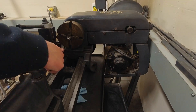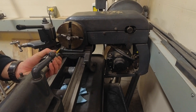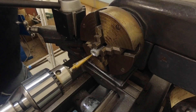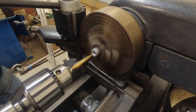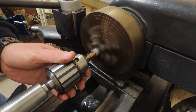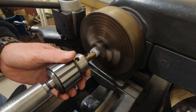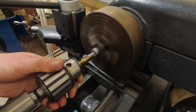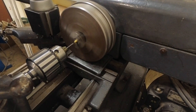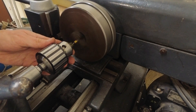The build notes say to use one of these cheap stepless drill bits as a tapered reamer to enlarge the bore of the hotend heatsink. These bits are intended for drilling holes in sheet metal, and I was skeptical of using one as a reamer, but it works pretty well. With a little cutting fluid, it had no problem reaming out the aluminum. I also used the lathe to drill out the brass nozzle from 0.4 millimeters to 1.7 millimeters.